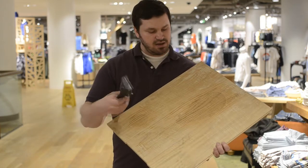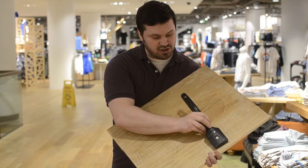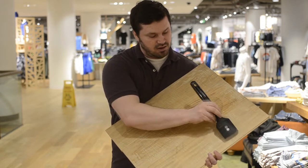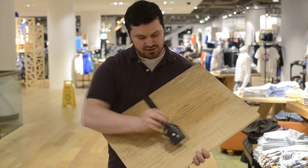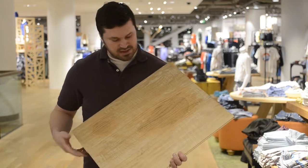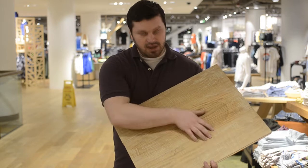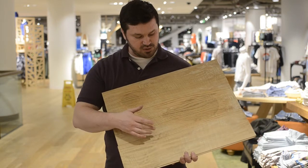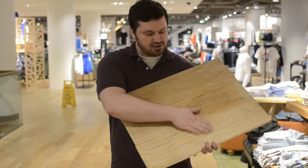I just modified a blade, and after we scrape it back, we take this and go across the grain, all in the same direction. You have to be careful not to have different angles on that piece of board. You have to keep it pretty consistent from one board to the next. Once we apply those tooling marks, we can then add our lime back into the wood.